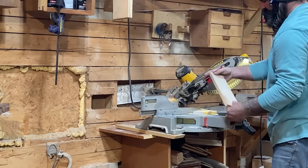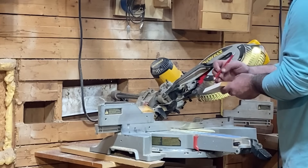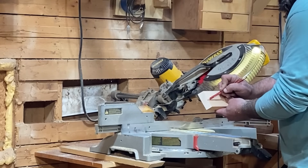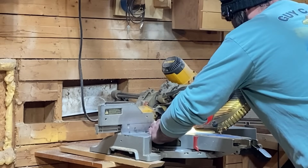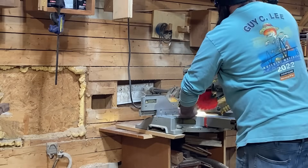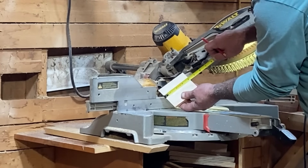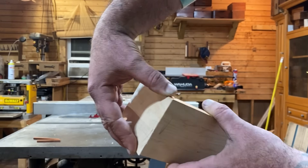There's our first piece at 13 inches square to long. Now we'll take our remaining piece, and you'll want to ignore this long point because we want our grain to wrap around. We'll make our long point directly at this short point — that way the grain stays consistent as possible. Make this cut nice and slow, being a smaller piece. Take your time, do not rush. And if we did our math right, it should be 4 inches — and look-a-there, we got 4 inches, so that's perfect. And this is how the grain lines up when you cut it like that.